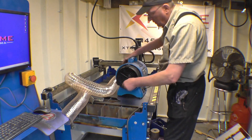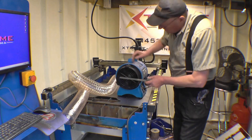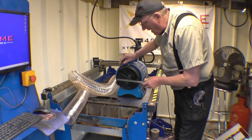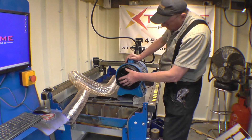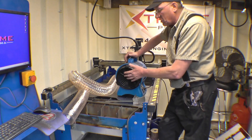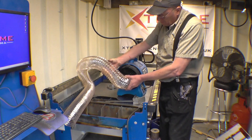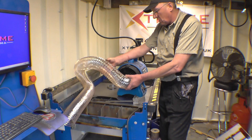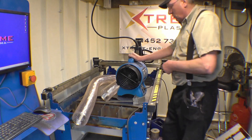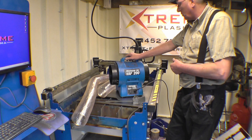I need to make a damper that goes from that down to that tube. The tube is 100mm nominal and this is 110mm. It will just lie in there with probably some tags welded on and a couple of screws, and I can weld a 100mm tube in the centre. I'm going to lose some performance but that's just too big to have that size duct on the actual machine. But that fan really does move air so hopefully it will do the job.